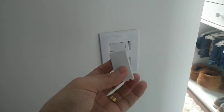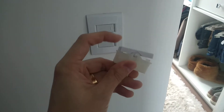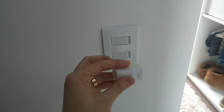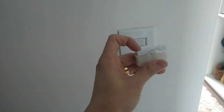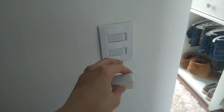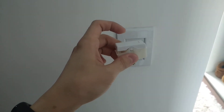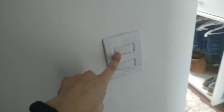What I noticed is that I used this Relay on manual. And what happened here? On this side, the Relay is on manual off. So, when I turn on the light, it will stay with on position on the manual. And when I turn off, off position on the manual. But when we use the switch on automations and everything, maybe we end up getting this position — on manual, but the light is off. And this is what happens that gets the switch confused.